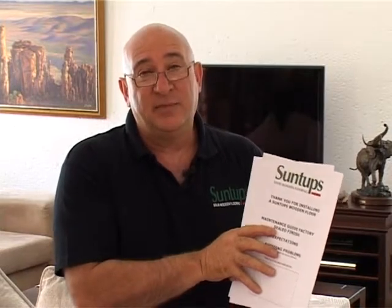Right, so while we're talking about oil floors and sealed floors, just like to mention the philosophy behind oil floor is that an oil floor, if maintained, lasts forever. You'll never have to re-sand and seal this floor ever. With a sealed floor, there's no maintenance, and as long as you're living within the correct methods of living with a wooden floor, then you would have to do no maintenance whatsoever. Your floor should last you about 25 years before you need to reseal this floor.